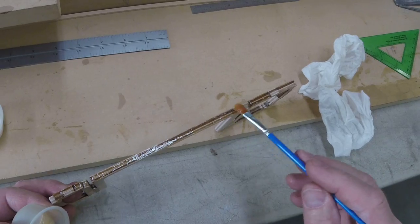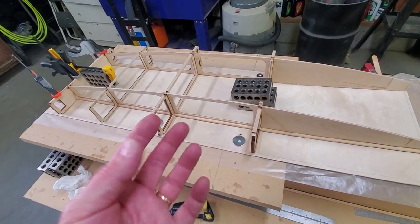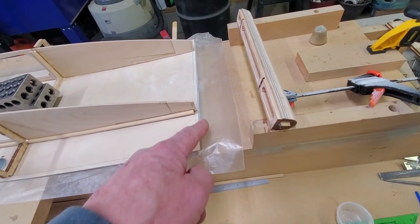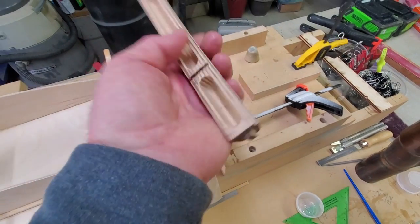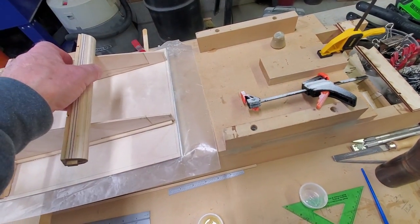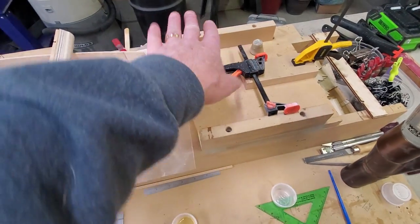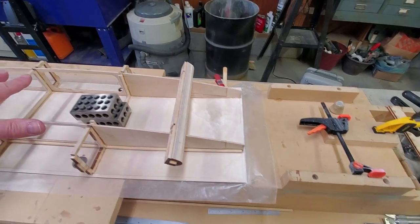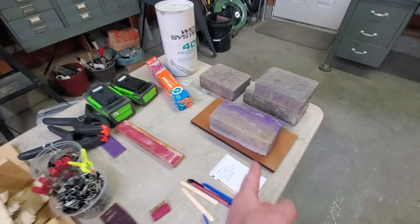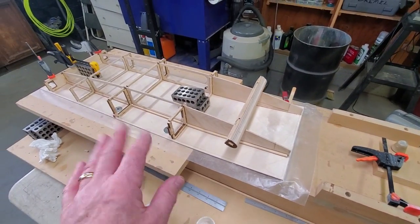Okay so I've found the limitations of the GoPro — I can't hold all that much on the card. Anyway, I've just been epoxying all of these joints really well. Next thing I'm going to do is epoxy this front area pretty thoroughly, then these slots on the bullnose and across the bottom. We'll install it, and just as we had done before, you need to rig up some way to put a little bit of pressure on it. I've made this clamp arrangement so I can put a little bit of pressure rearward, and then we're going to put weight everywhere on here as needed to get all of these pieces pressed down thoroughly — that's why we have a whole bunch of bricks handy and some weed whacker batteries and such.